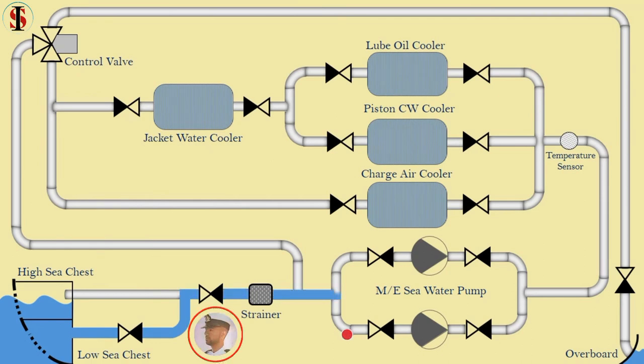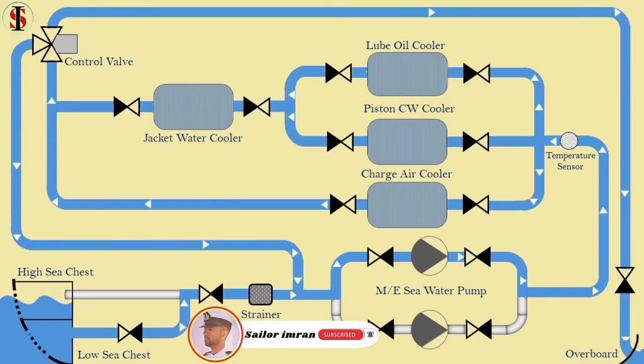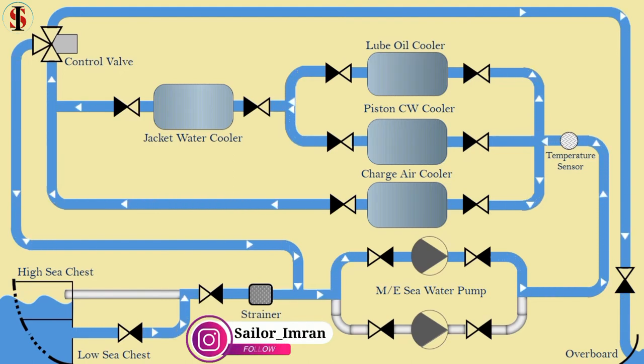Seawater is pumped continuously into the vessel from the sea chest and discharged once it has gone through the engine room heat exchangers. High capacity centrifugal pumps are used to suck in and throw out a high volume of water in this loop all day every day. In the engine room, the seawater removes heat from various heat exchangers. The seawater makes its way to the engine jacket heat exchanger, lube oil heat exchanger and various other heat exchangers.